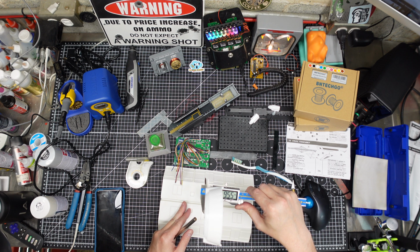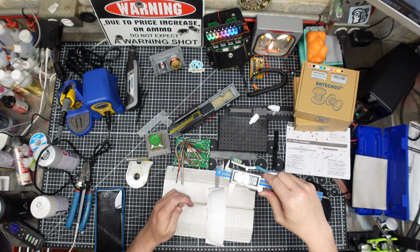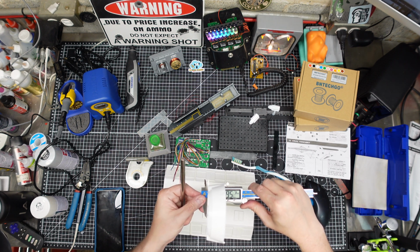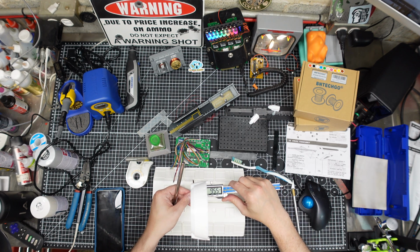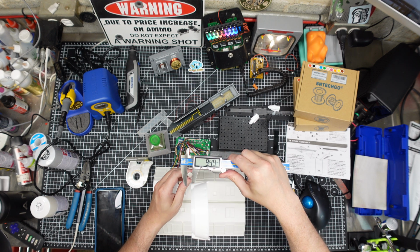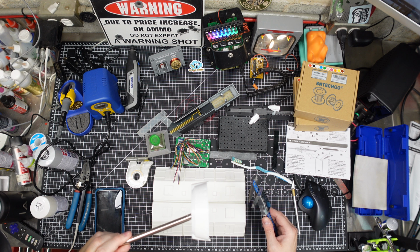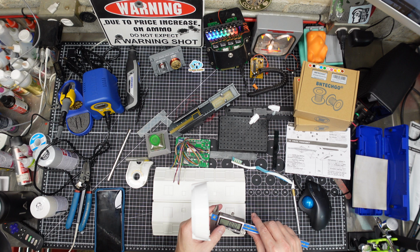See, that's how crappy these calipers are. I mean, they're decent-ish, but or the tube's just varying diameters. No, it's pretty consistently 9.51, 9.52, 9.49, 9.48. Yeah, this is a tiniest bit thinner, and it fits in a little easier. This thing fits super tight, the K&S tubing. So there you go.